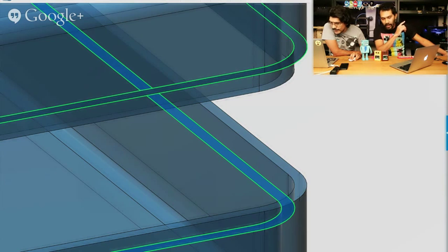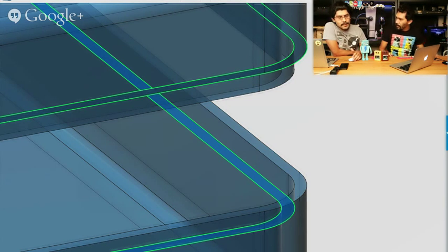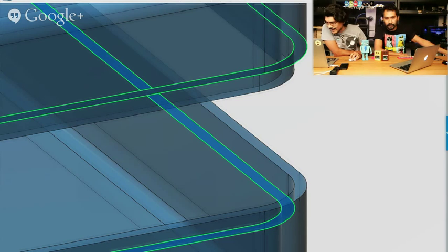And real quick, the sizing between those two lips is like 0.4, 0.2 difference? Oh, no way. It's just 1 millimeter thick, and they're about 2 millimeters tall. Remember how I made it 2 millimeters thick? So that way I can have at least a millimeter of room to make this little snap fit lip. Okay. That's what I'm calling it.